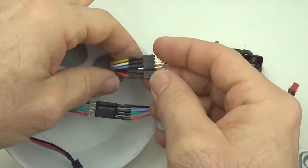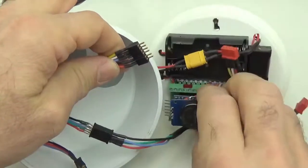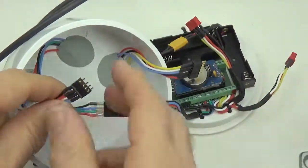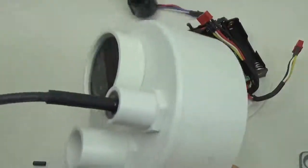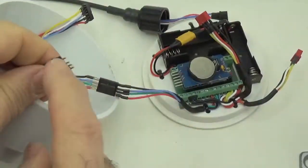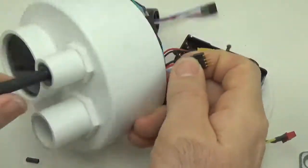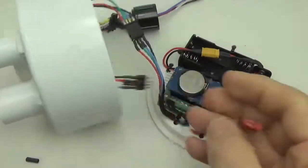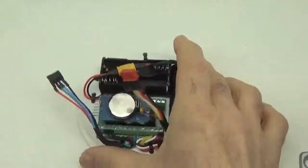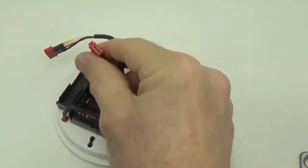And so this is the connector that I was talking about for the display, which we didn't connect. We don't have the analog lines broken out, but if we did, that would plug in here. And then this is a pass-through that goes through the housing, and we're going to talk about that in the next video as well. So you can hook up any sensor you want. In fact, you'll be using this kind of housing pass-through wire for the Atlas sensor. Okay, but for now, we've just basically got what we were after, which is the logger is now able to power itself and we can hook sensors to it.